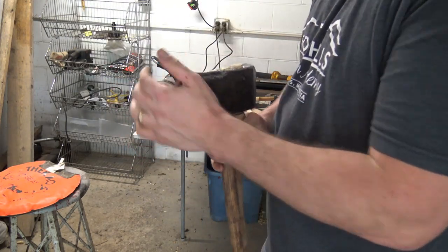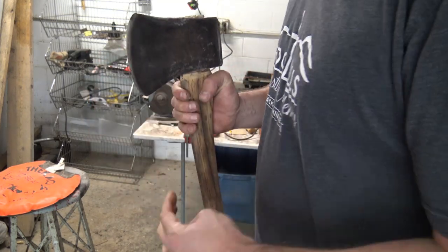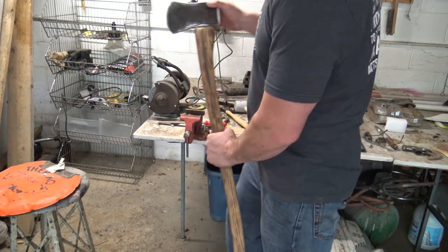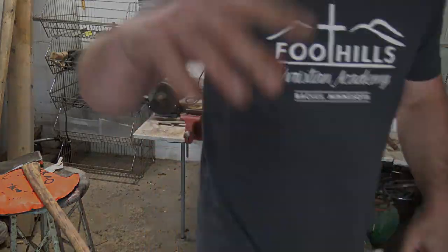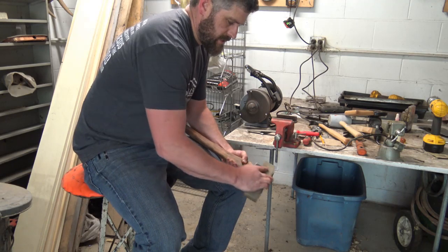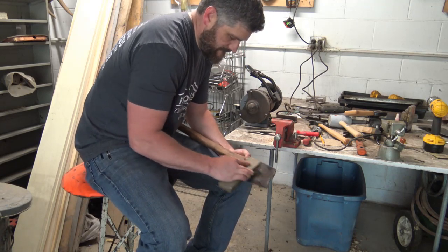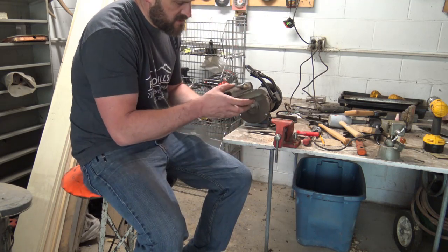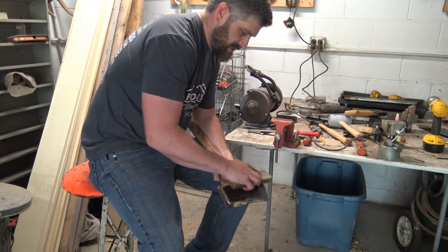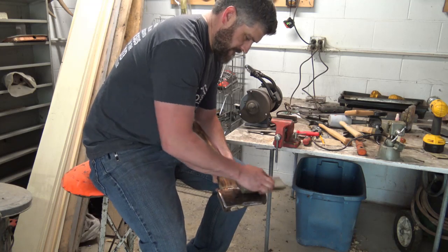So now we've got this, I'm gonna grab some water and hit a touch of stone to this for a little bit. Now with the grinder, I did get this fairly close, so it should be a quick process, and that was my goal. So let me get a little water and get right back here. So what I'm doing is I had a burr on it from that grinder, and I'm gonna go until the sanding lines are out of it, which they almost are.